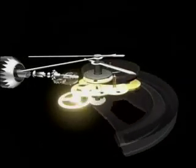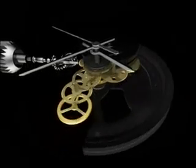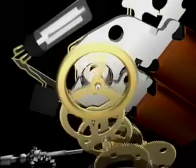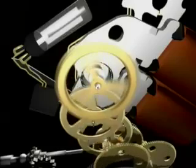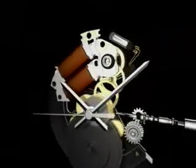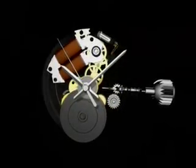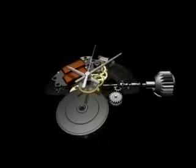A special regulator called the tri-synchro regulator controls the movements of the hands. A small fraction of the mainspring's power is used to generate a tiny electric current. This is enough to drive a quartz oscillator and an IC. The precisely accurate reference signal from the quartz oscillator is coordinated with the speed at which the mainspring unwinds. A delicately controlled electromagnetic brake is applied to ensure that the mainspring unwinds at exactly the right rate to match the quartz oscillator for accurate timekeeping. Because of the electromagnetic brake, the hands keep virtually perfect time.